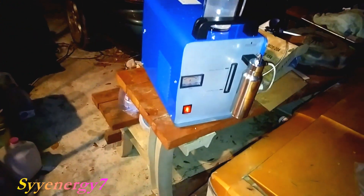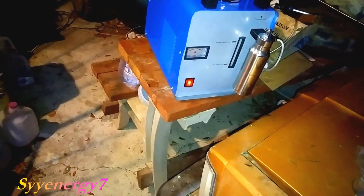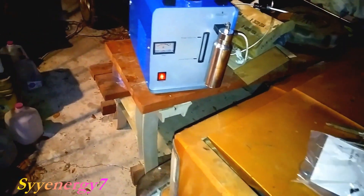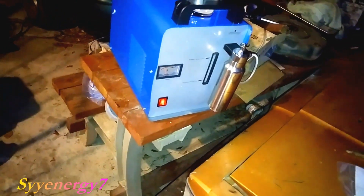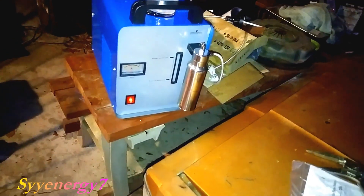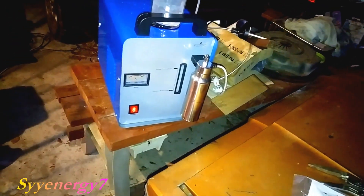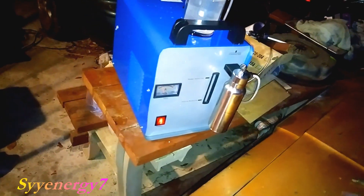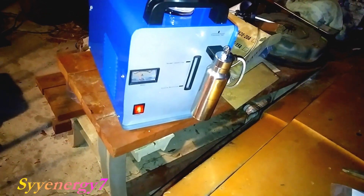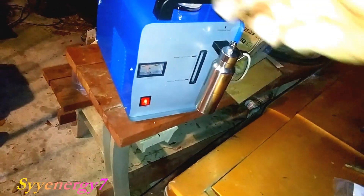This unit costs about $128 or $129 delivered. I haven't really had any problems with them. Just remember to use a timer on it and make sure you watch your water levels. I'm not sure about the internal pressures — they were listed on eBay. I just didn't have any problem with them. I would definitely run a timer though, because if you leave it on and it runs low on water it'll get really hot, and that's not good with HHO. They're selling these as welders, so I'm not making an open flame — I'm just bubbling it through water.